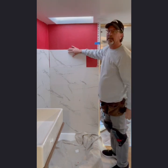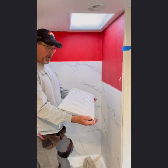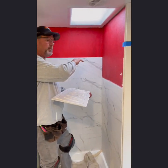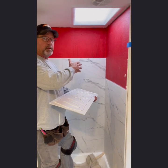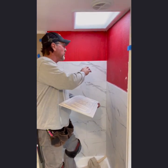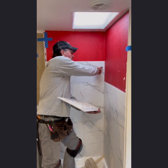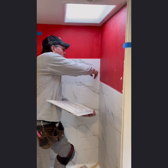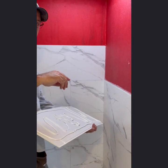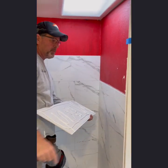The company that makes these tiles — I just wanted to point this out — they make an inside corner piece, but I just don't like the way it looks. You can do this without the inside corner, but you have to do a little extra work. We double-silicone each piece in the corner: this piece before it went on was siliconed in the corner, then this piece goes on and that seals the corner off really well. Then you always put silicone at your joints where they come together.